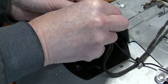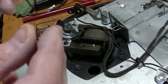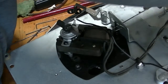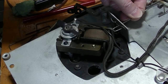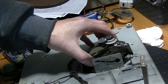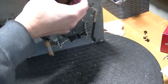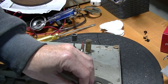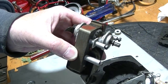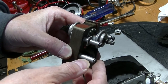There's a grub screw and that has come out. The grub screw goes inward. This hook goes underneath that. Pulling out these three screws has loosened the motor, but it still won't come out. I guess then it is these two nuts on the top. When you take the motor out by removing these three screws, it literally comes apart in your hands.